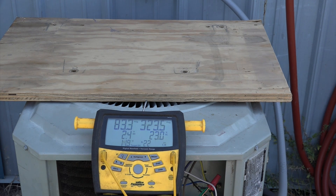So what's the point of this? It tells me that if I'm using a fixed orifice machine, I need to be sure that my coil is clean, the fan is working properly, all these kinds of things. Make sure that your head pressure is in a normal range. Right now I'm at 350 pounds on my head — it's way out of hand, and there's virtually no superheat at all.